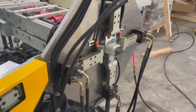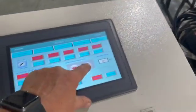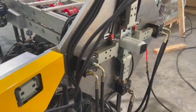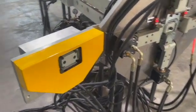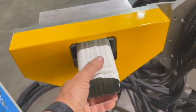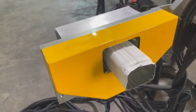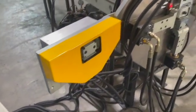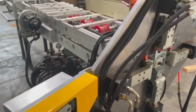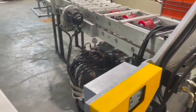So I turn that, then jog it out a little bit, and there's my piece — I can pick it right out from there. A very nice cut. And then if I stick it in here, I can manually hit the button for the tube out and I have a nice four-corner crimp. So that's how it is on manual mode. And then you can go to the automatic mode.